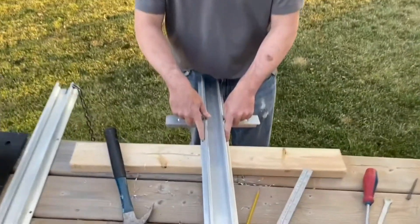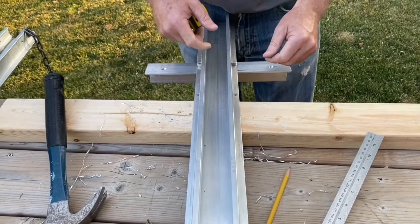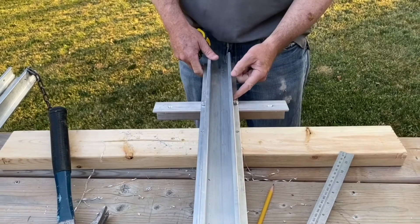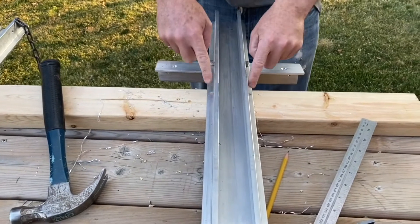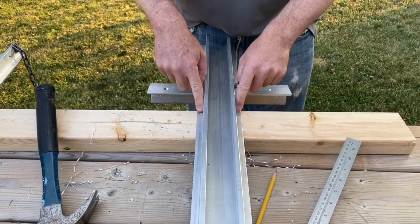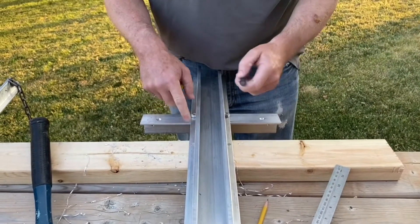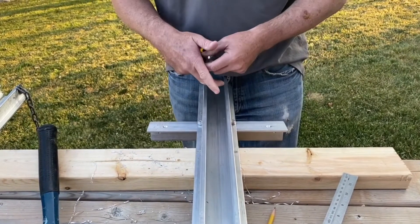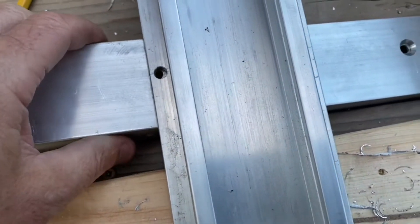When I talk about centering: it's very important that you mount the holes in the center of the flange. If you don't, the nuts will interfere with the bracket and you won't get it mounted. Measure twice, drill once — use the center punch to mark it, use the one-eighth inch bit to get it nicely centered, then follow up with your quarter inch and it'll be perfect.